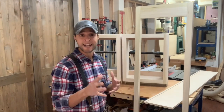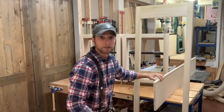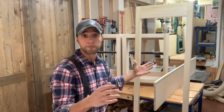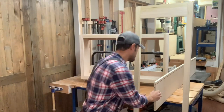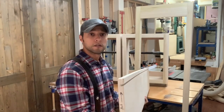The reason I'm choosing not to do it on the table saw is that if you sight down a piece of plywood — now no matter how much you spend on it, this is $60 a sheet, sometimes $90 a sheet, American-made cherry, red oak and things like that — they still have a tendency to bow. This started out real straight when I got it from the hardwood dealer, and now you can see it looks like a banana.